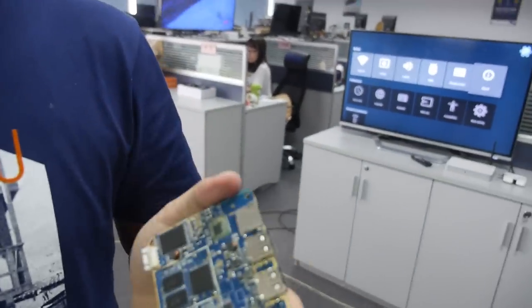This is HDMI 2.0 full 60p, so everybody's happy. It supports H.265, 4K/2K, and 10-bit color. 10-bit means the color will be more clear — when you have color changes, like red to blue, it will blend more smoothly so it looks more natural.